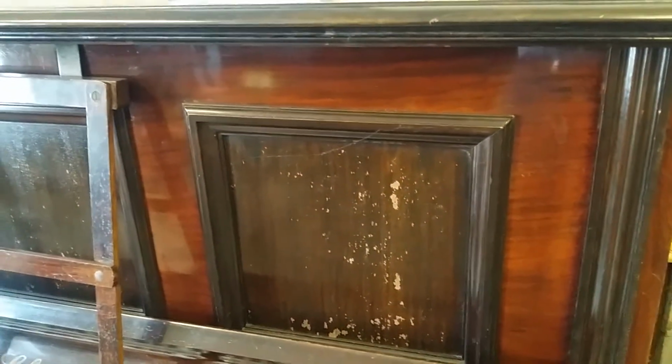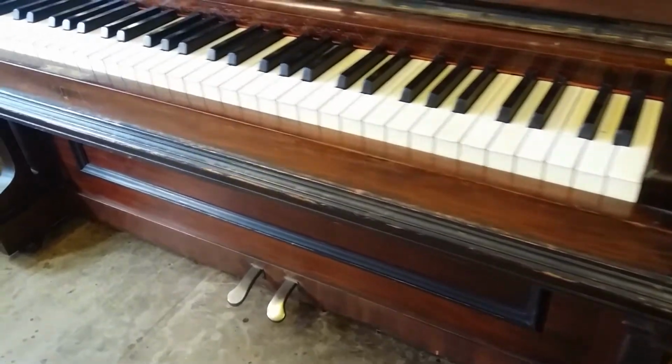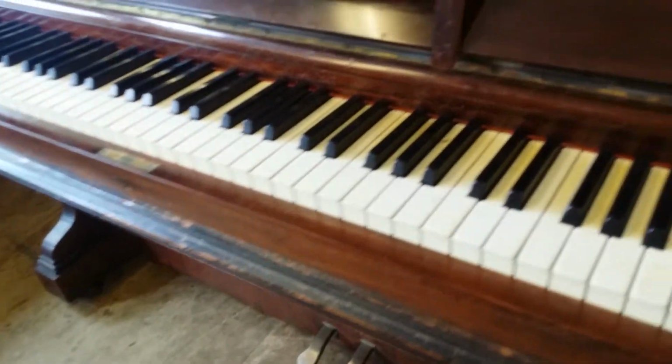In fact, this panel here has been changed. The piano is actually rosewood. This panel may not be rosewood, it looks more like mahogany, and we're going to have to see if that matches in properly. We do French polishing on pianos, and there's an example in the polishing room. This is a walnut Bluthner grand piano, and we apply about 30 coats of French polish, finishing off by waxing and antique waxing. So I don't think there's any doubt about this piano needing repolishing before it's rented out.